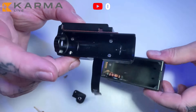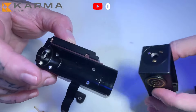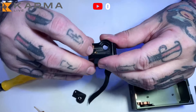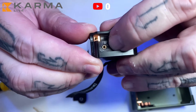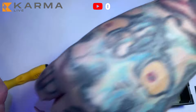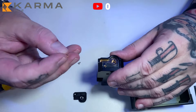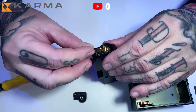I want you to notice that the screws of the plastic housing thread into aluminum — this body is aluminum, though it is quite thick and heavy, possibly an aluminum alloy. On the other hand, that small screw that holds this cover has a brass threaded insert so it doesn't thread directly into plastic — which I find to be of spectacular attention to detail. A screw threading into plastic can't last long, but since this isn't something you'd remove constantly, it's still spectacular that they included that brass insert in the plastic.